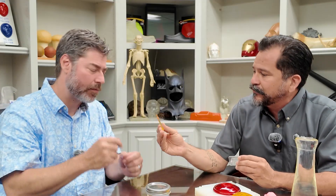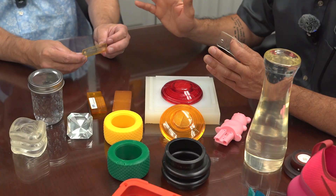With non-UV stable materials, they may start off very clear — this is one of our fresh samples, our F-105. It's super clear. But over time, the material starts oxidizing and darkening up a little bit. This sample is probably about a month old, and you'll see the yellow starting on the side — it's going to keep changing color, getting darker the longer it goes. When you add pigment like a white to this, you're going to notice the change a lot more than with something like a green. Black is always the best option — if you're able to go black, you're not going to see that color change. It acts as a UV inhibitor.